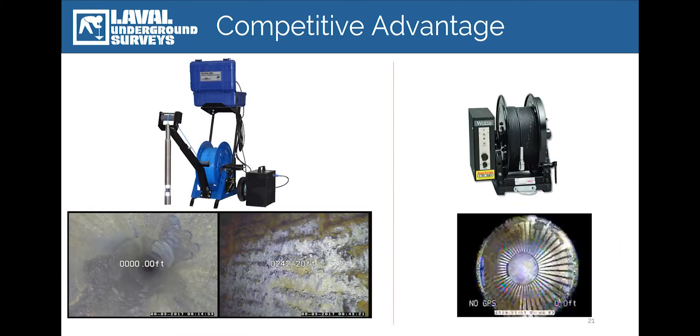This slide highlights the image distortion to an even greater degree. The images on the left were collected from an ARCAM-1000 XLT utilizing the same wide-angle broadcast-quality modules found across our entire line of borehole cameras. The images on the right show the distortion caused by using a fisheye lens as opposed to a wide-angle lens or a dedicated side-view camera. Many fisheye lenses have been repurposed from other industries such as automotive backup cameras and were never designed to provide the definition and clarity required of a downhole application.